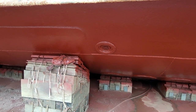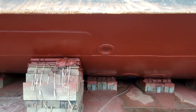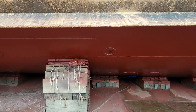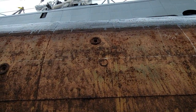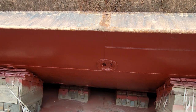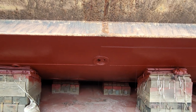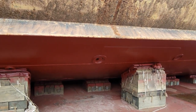A little bit farther down, just forward of the conning tower, you can see another intake — we believe that's for the air compressors — and that's just underneath the control room. Just above it would be your discharge. We're going to be leaving that one open. Right next to it is a discharge and below that is an intake for your air conditioning. This is the one I've been keeping an eye on for years. We're going to be blanking that over as well; we don't run the air conditioners, they're not operable, so we don't need to leave open areas in the hull that don't need to be left open.